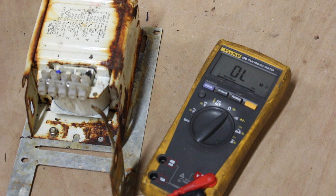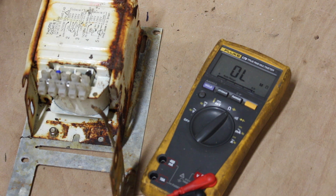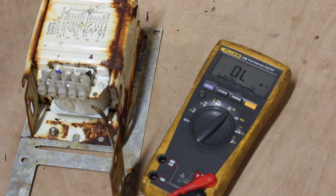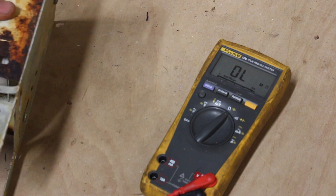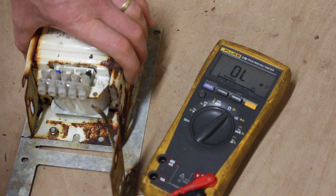The integrity of the coil of wire inside is what we're looking at. When these fail, generally the coil draws too much current and burns out, resulting in the lamp not lighting at all. They can also fail when the insulation inside breaks down, causing them to buzz very loudly. If they do fail, there's nothing that can be done — you just have to replace them — but they are very easy to test.